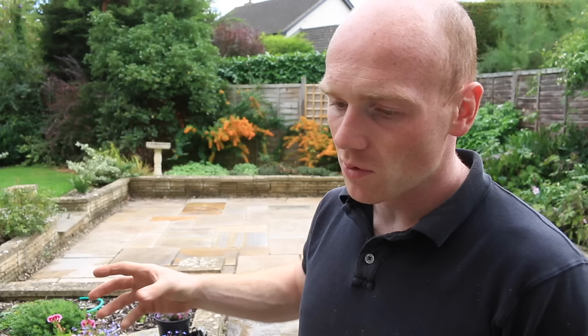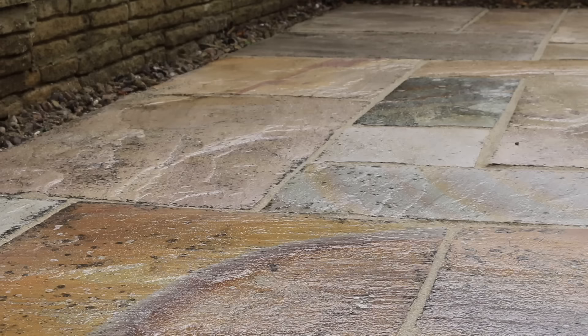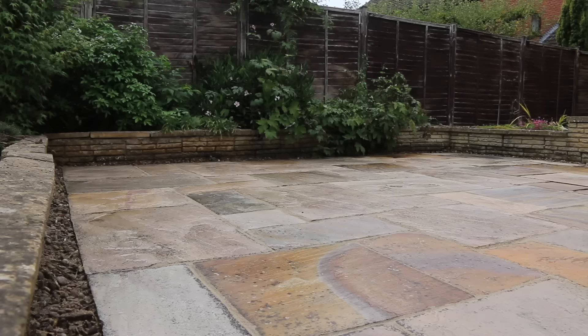All in all you're probably looking at around £40 to £50 worth of materials to do this. If you value your time, or it's wet weather, or you don't have the skill set to point with sand and cement — and even if you do, you've got to be careful of staining — then this is a really good way to go. This isn't a sponsored video at all; I just had this left over from our patio project a few years ago. That said, it's tried and tested at our house, so I'm happy to stick our stamp of approval on it. We used the buff colour, but to be honest after one season it greys anyway, so I wouldn't worry too much about colour matching.